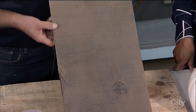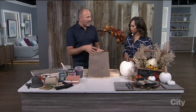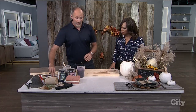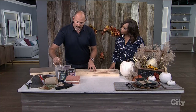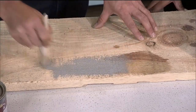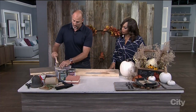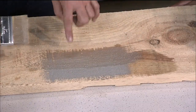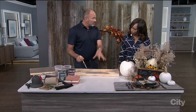This is literally just a rough-hewn plank from a box store — the whole thing, 12 feet long, cost me $6, so I could cut them all up. Then I thought, Carson, I can do better. So I decided to get some stains — wood deck stains I work with all the time. I wanted to have a little fun with layering colors. Stains come in a couple of different applications. This is called solid hide — looks like paint, just sits on top of the wood. However, this one is a semi-transparent. When you layer a semi-transparent over top of a solid hide, the semi-transparent soaks in and shows wood graining, whereas the solid hide sits solid — I used those for the actual tinting.